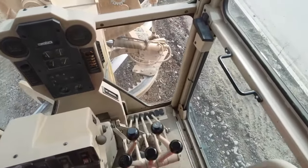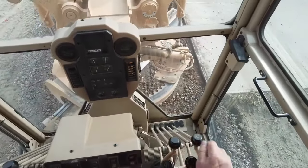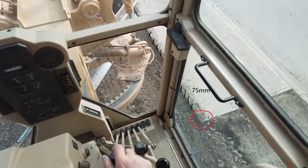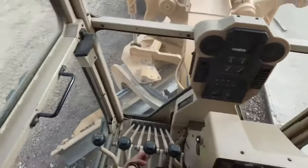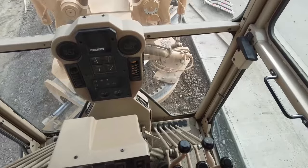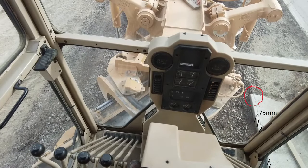Here we are working on a trail — again 63 mil with three percent crossfall — and the existing structure is a bus pad. As shown in the diagram, we're looking for 75 mils along that bus pad. The critical area is the corner; as you get away from the corner you're fairly safe, but you have to be careful of those corners or somebody's going to be re-pouring that pad. Another critical spot is when you exit this pad — as you go just past it, you have to be very careful that you don't nip that corner off.